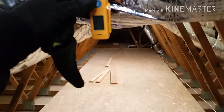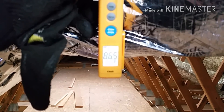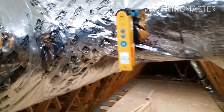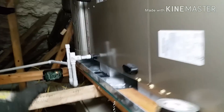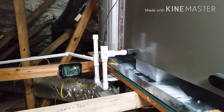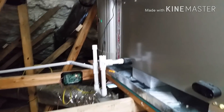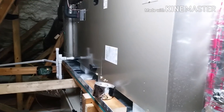It's getting there, and you can't beat these temperatures — 86.5°F supply and 58.8°F downstairs, and that's still slowly climbing. Also a deep trap with the variable speed blower so it doesn't pull water out of that trap when it's running in high stage. Pretty damn badass system.